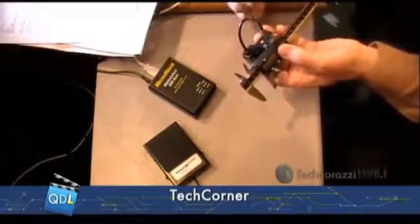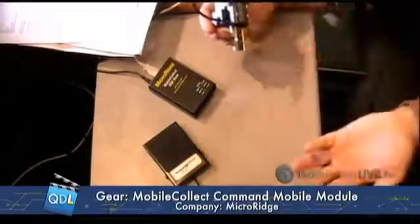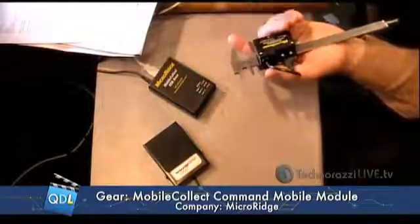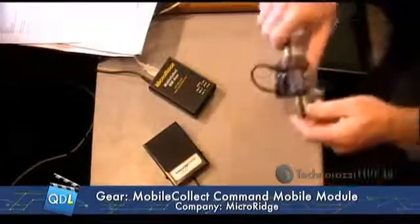Also, you're not locked in to the cable — the cable and the box are two separate entities. So the remote module, if I wanted to change this from a Mitutoyo and connect it to an Ono Sokki gauge, all I would do is pop off three screws, take off the back, replace the cable, put the back on, and plug it in. Three or four minutes and I've switched gauges. Very simple.